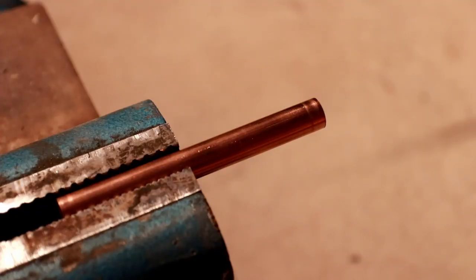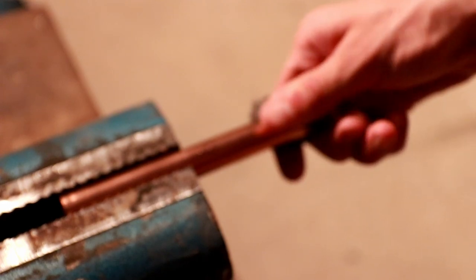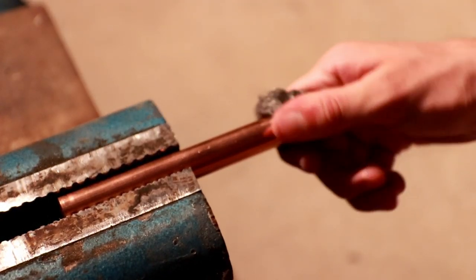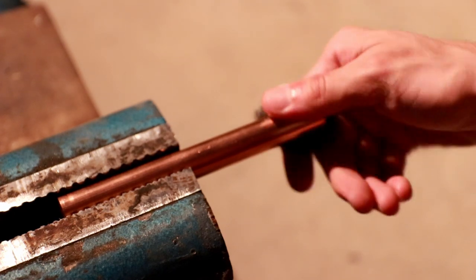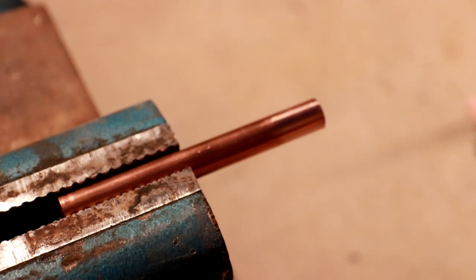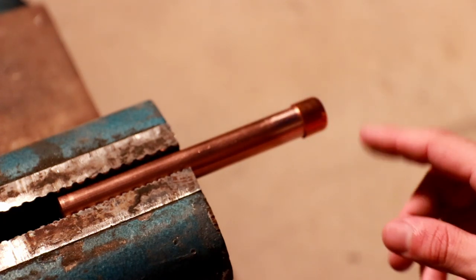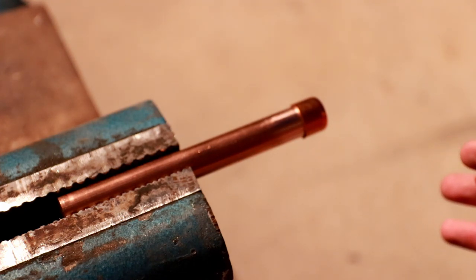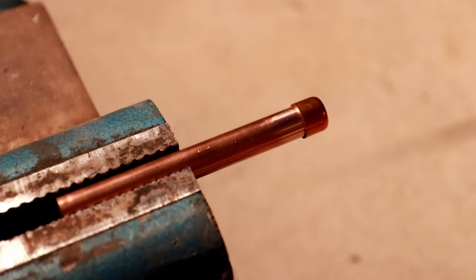Now that I've tested a few things, I'm going to do one more practice run with a confined angle of access to the joint, trying that on both sides of this pipe. The whole point is to see if the reach-around method for limited access is viable and if I can make these connections repeatedly. I'm not going to pressure test this one — just visually inspect it — and I'd like to do both sides without needing to reheat the pipe more than once. I'm going to get my brazing rod bent into something of an arc so I can approach the line from the back side first.